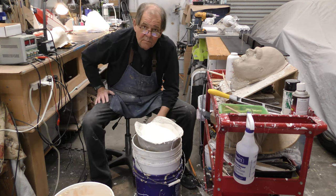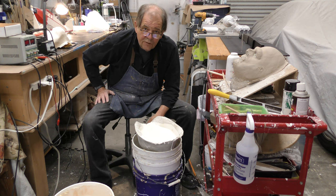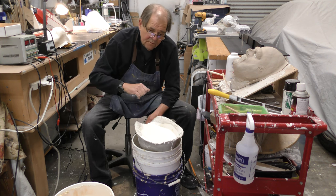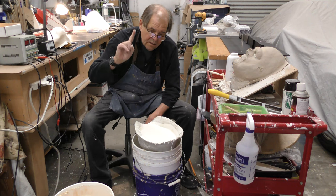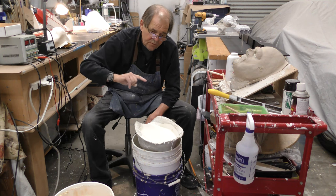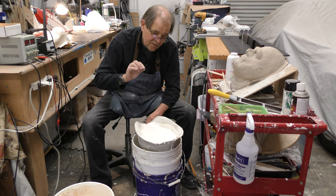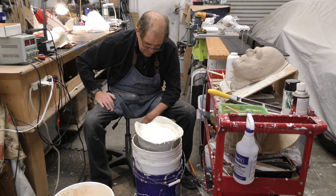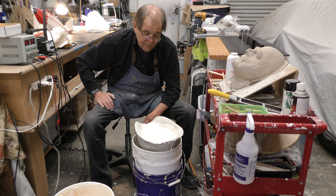And that's what Prosade and Cabosil is for. We call it Bondo. You mix Prosade, prosthetic glue essentially, which is a white material, with powdered glass, which is what Cabosil is, and you get this nice paste, and you can fill in the bubbles, you can fill in deformities. Take your finger like that, go over it, smooth it with spit or whatever you want to use, and you can actually kind of sculpt it, so you can repair stuff. You don't have to throw it away because it's got a bubble in it, and we do that all the time.